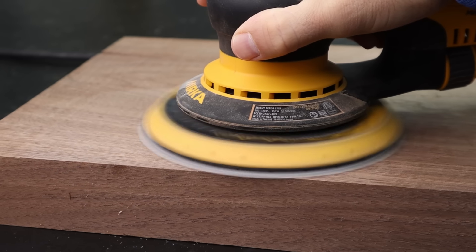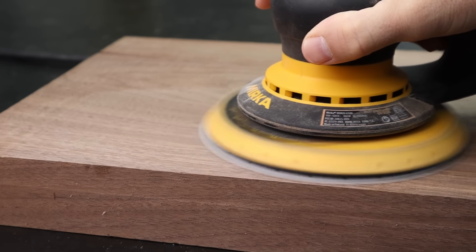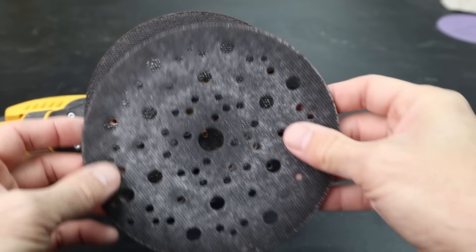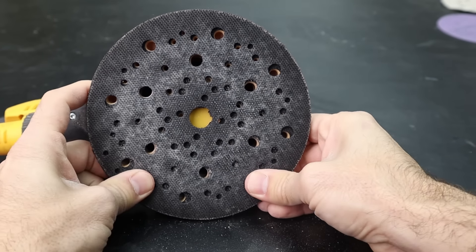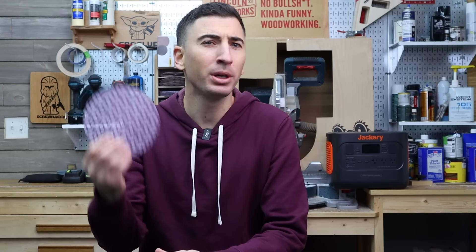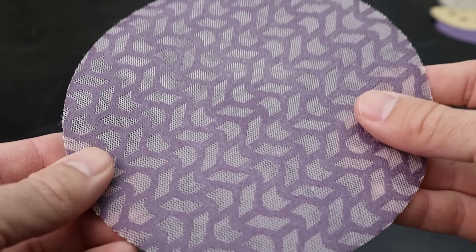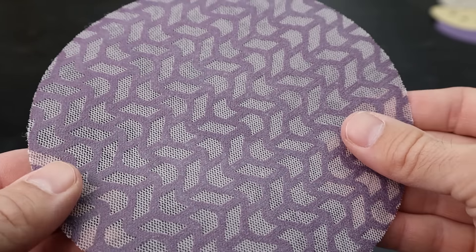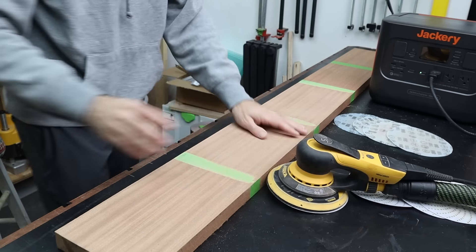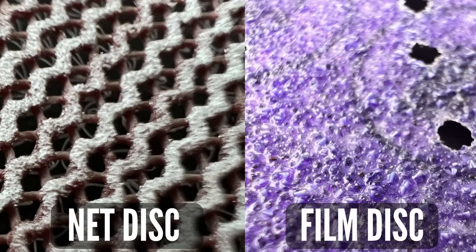So if you're one of those folks who doesn't like cords and hoses, don't use these because you're going to burn through them faster and spend more time sanding. Additionally, net-backed discs are more likely to shorten the life of your sander's pad. So I'd always use a pad saver that costs only $6 or so to replace versus $20 to $30 for the pad. In fact, even if you're not using a net disc, it's a good habit to get into. 3M currently offers two net-backed discs, and we will start with the wildly popular 710W. I have no affiliation with 3M and no one is paying me to say any of this — this video is based on facts, thorough tests, and my experience. You've probably heard the 710W referred to in woodworking circles as "extract," however that refers to the benefits of excellent dust collection when using 3M's net-backed discs. Companies like to market this as dust-free sanding, but that's not accurate — it should just be called less dusty sanding. But when you gain in dust collection, you generally lose in material removal. That's because the round fibers of a net-backed disc can't hold as many abrasives as a nice flat surface found on their film counterparts.